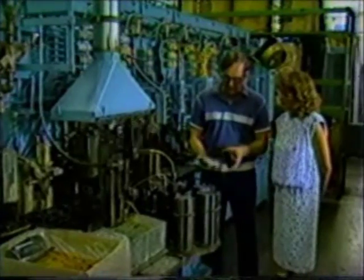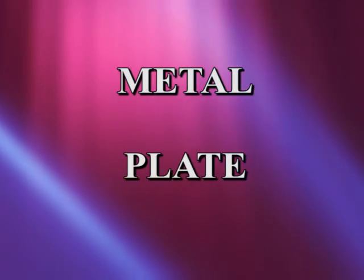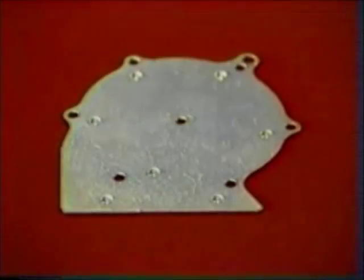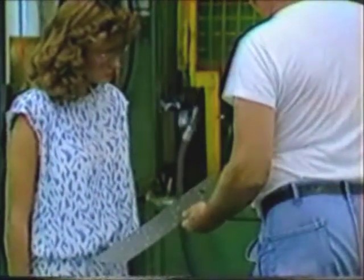This operator places projectors on the inline. To assure a positive air seal for the air column, 400-degree hot melt must be applied uniformly between the projector and metal plate. Coil stock is fed through a die, flattened and trimmed, and through progressive steps is transformed into a finished plate.